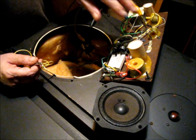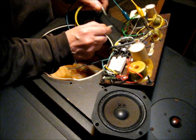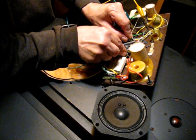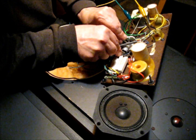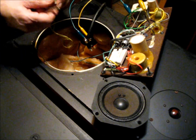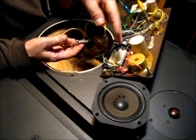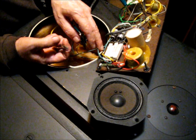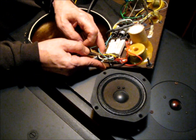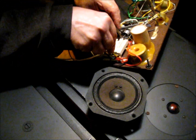My first step — I'm just going around here and banging on these caps a little bit to see what I've got. I didn't get any change by shorting across these caps. I'm going to change them anyway. So I started on the resistor bank, and I could identify and trace the circuit to make sure which one is which, but it's faster just to bang through them here.